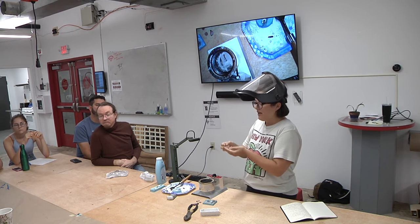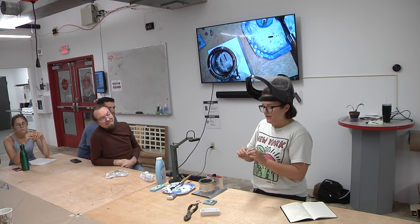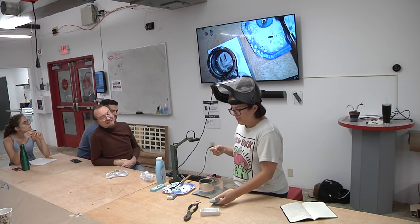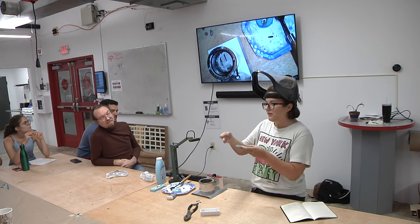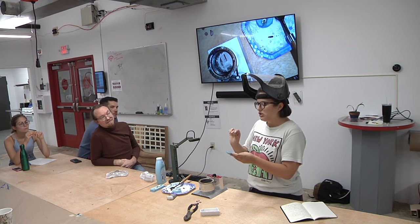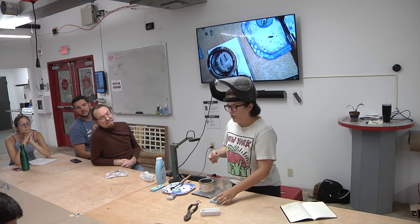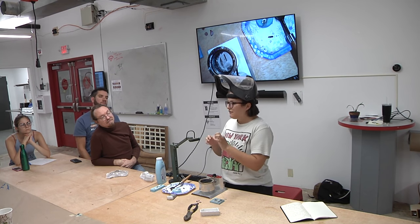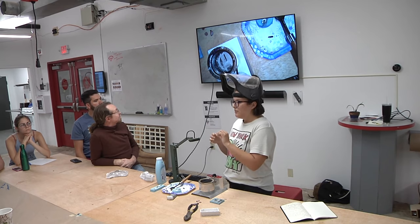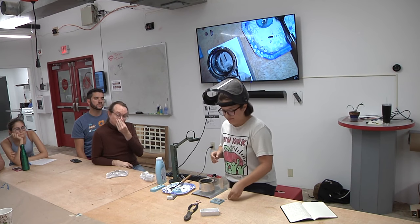That was just a product of my design process. I tried to design these pieces with the holes for the other parts of the jewelry already in them. But since I learned that for the shallow mold I have to spread it around, it wasn't possible to keep the holes in the pieces. That's just from the way my design was sitting in the mold when I cast it. These file right off, and obviously I could have gone back and redesigned my pieces as flat shapes, but I didn't really need to and I didn't want to spend more time 3D printing and using Bondo.